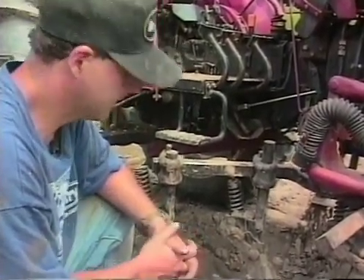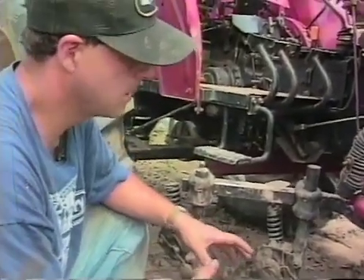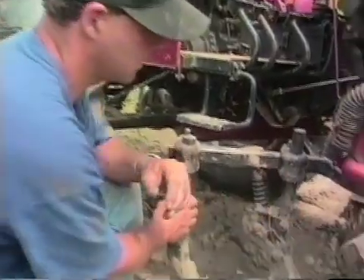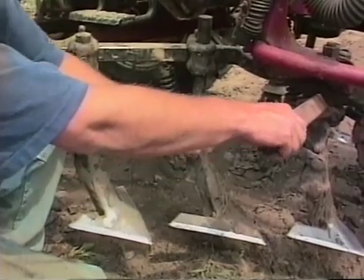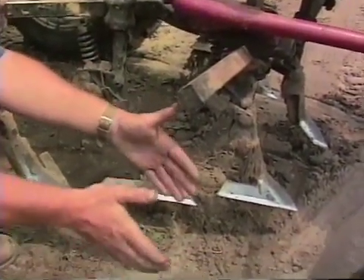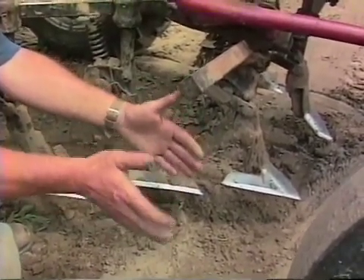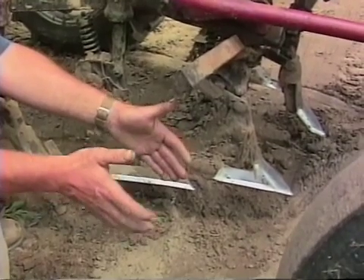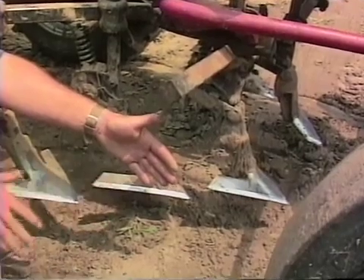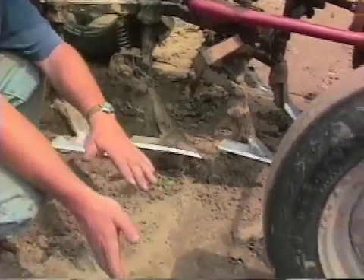When we first started farming, for several years that just meant an interminable amount of hand weeding. But now we cultivate differently: after taking the remay off, we remove these two sweeps and move the half sweeps out, reversing them so the sweeps are just inside the tire tread. We can go right down along the edges of the plastic — sometimes it'll even throw dirt off the plastic — but it flips out and rolls over any weeds growing in that area, almost in a plow-like fashion.